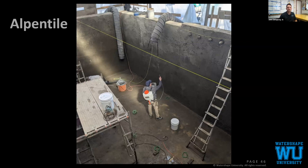Not only is that good for day to day, but if there is ever a warranty issue, we would have logs to be able to show that these are all the pictures of the steps we took, and this is the temperature in the vessel in the coldest areas throughout the process as well. One thing we did is we drilled holes in the 2x4s. We pulled the bond wires through the 2x4s, and then we screwed those to the floor so that as people walk, they don't accidentally kick and snap off one of those bond wires. It gets lost, or we have to demo and fix it.